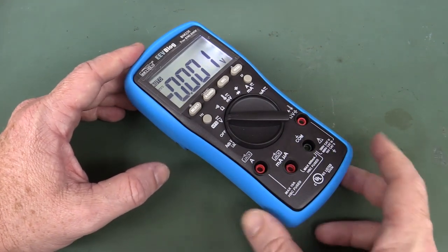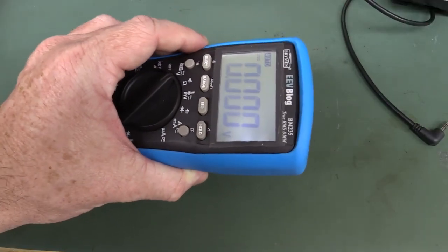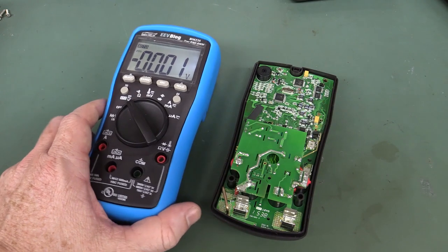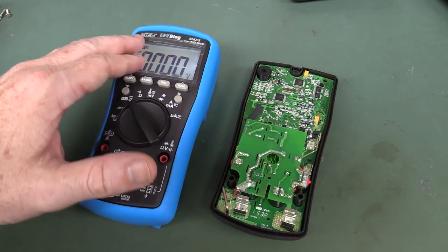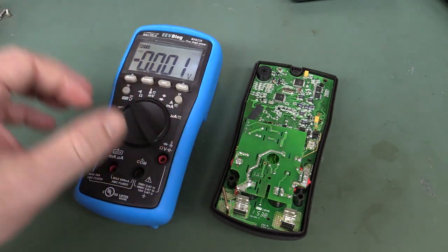It's something I've mentioned way back in episode number 33, part 2, back when YouTube had 10-minute time limits and I had to do two parts. I'll do my best to try and get this sound on the microphone — it's incredibly difficult, I've tried different microphones — but I'll give it a bash. If I speak very softly and whisper with my gain turned all the way up, that's the backlight on, and I'll turn it off. That's now off, it should be gone, and back on. You clearly heard that tone there; it's around about 5kHz or so, and it's clearly coming on when you turn the backlight on, otherwise it's completely silent.